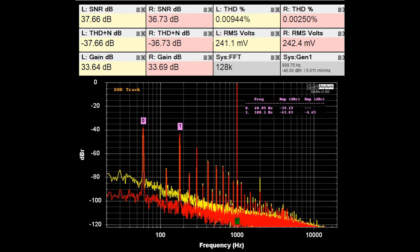As is typical for receivers with phono inputs, we're measuring the THD and SNR at 1 kHz of the phono input to the tape monitor output with a 5 millivolt signal applied. The phono section gain is about 33 to 34 dB. At 60 Hz we're only 39 dB down from the 1 kHz signal, and at 180 Hz only another 4 dB down — you want those to be much further down. You would most likely hear hum when playing back a phonograph.